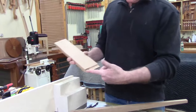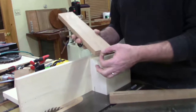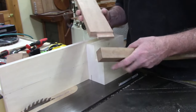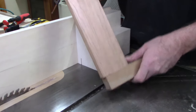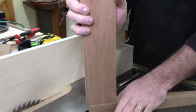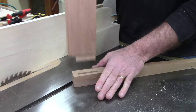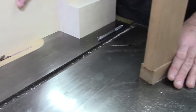Okay, so normally I'd make those cross cuts on the table saw, but I just want to check the cheek thickness, and that fits in there sweet. That's nice, huh? So there we have it, a beautiful, true tenon on our new setup.